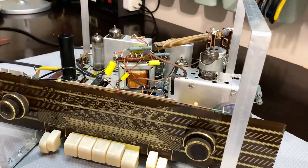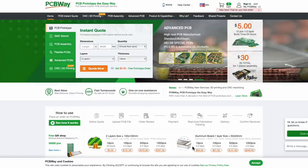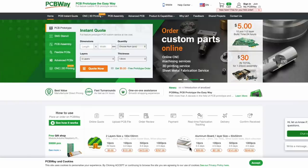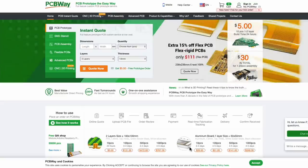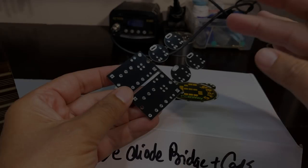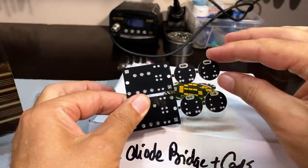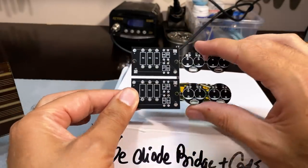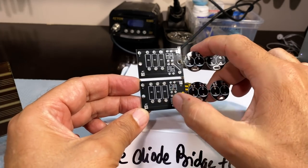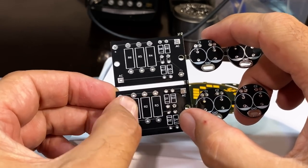If you've seen one of my other videos, you'll probably remember I did a little project with PCBWay. Before continuing, I want to thank the sponsors of this video, PCBWay. Besides the PCBs I normally order for my projects, they offer a full prototyping service including 3D printing, CNC, laser cutting, injection molding, and anything else you need to take a project from design all the way through to completion. I had these boards made - you break them off and end up with pieces to replace the filter caps, and this one here to rebuild the selenium rectifier with four silicon diodes. There are positions for the diodes and positions for three resistors which you can put in parallel to give you the voltage drop you need.